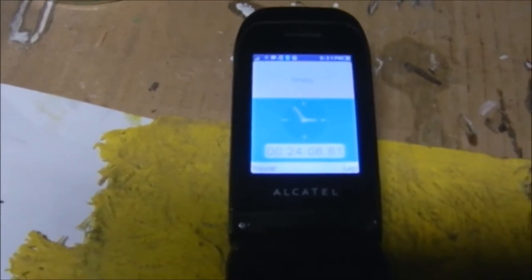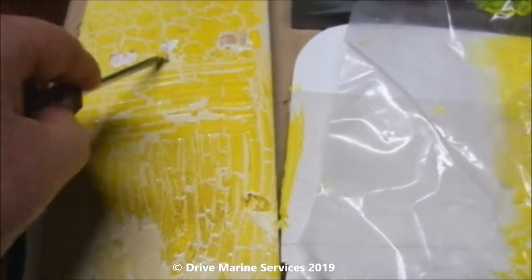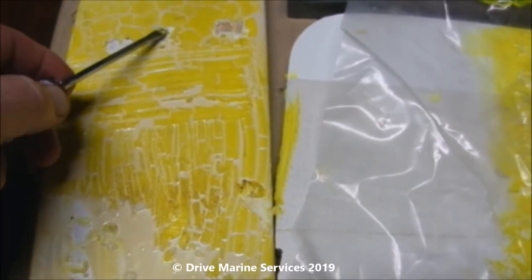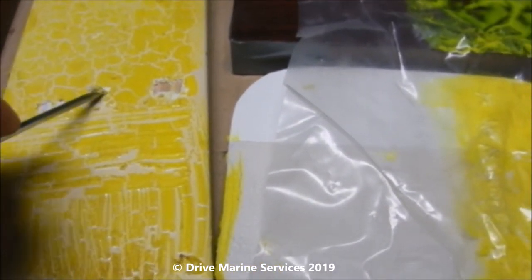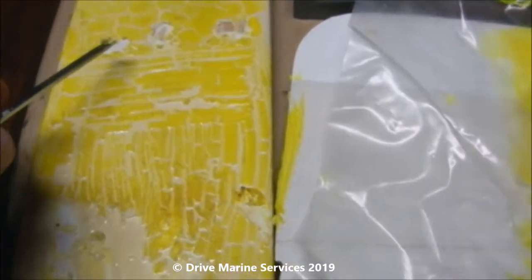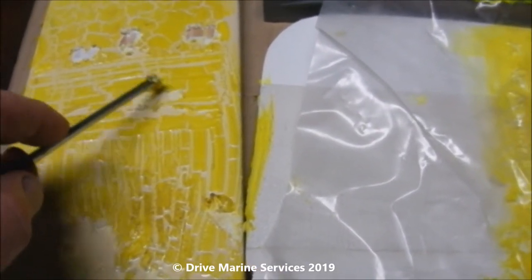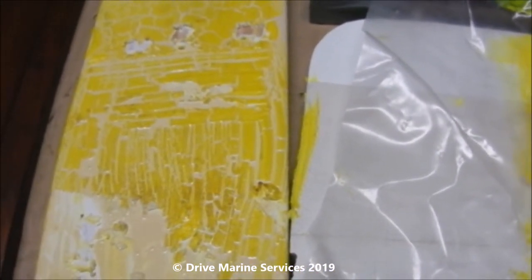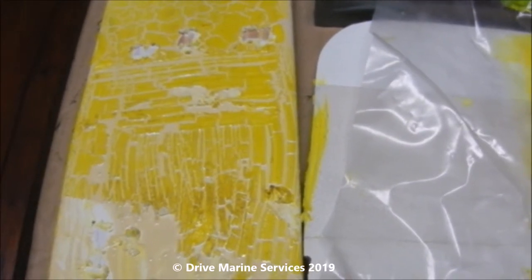At 24 minutes I'm just scraping back here — it's starting to work its way through the undercoat, could do with a bit longer. The surface has dried out but it's wet underneath, which is pretty neat. With a metal scraper you'd just about get that back. But the top coat lifted off really easily — within five minutes. Good stuff.